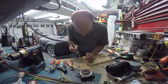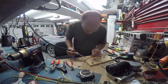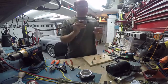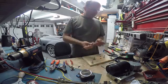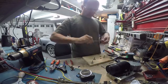I'm going to solder the connectors on here so they stay on good. After this, I'm going to twist the wire into a spring shape, and the only purpose for that is making it shorter so it fits on the base. It has nothing to do with the resistance of the wire.